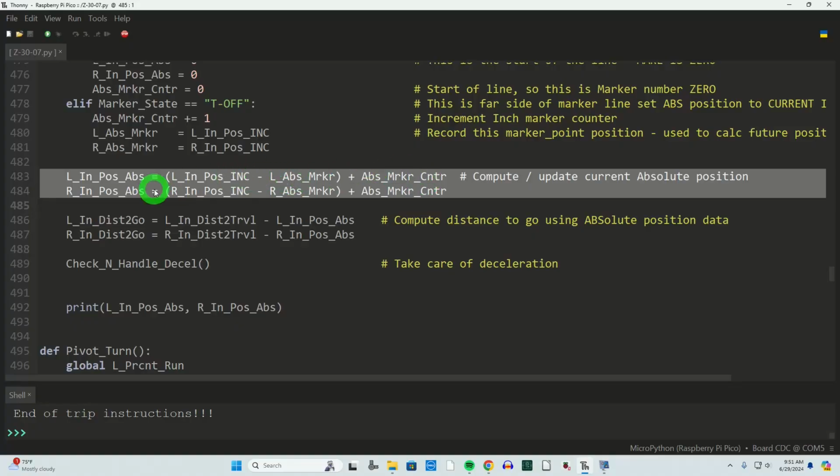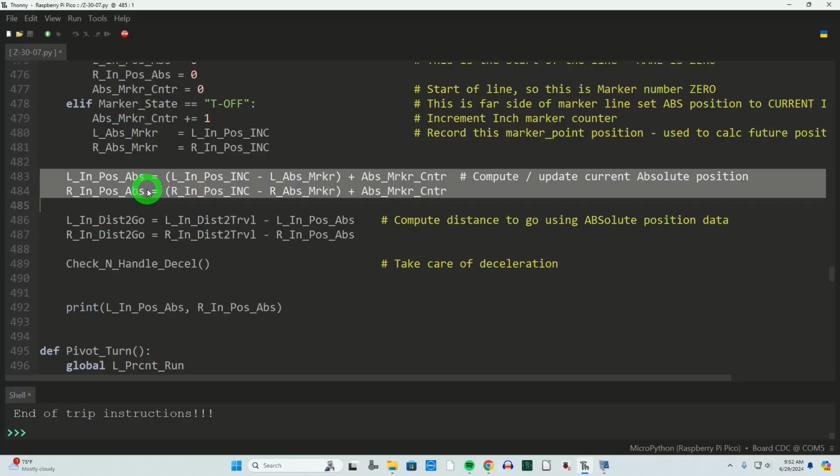This little calculation here is just telling me the difference in the encoder count, or distance traveled from the encoder count only, in that little 1 inch travel distance. That gives me a much greater precision. Now, if there's a lot of steering on there, like before when I was poking the car and it would go way off course, this could still have a substantial error in it if we're measuring right at the point where the Zoomie is really twisting and fishtailing around. So this still isn't perfect, but it is a huge improvement.